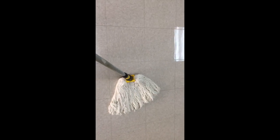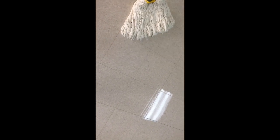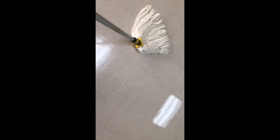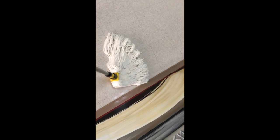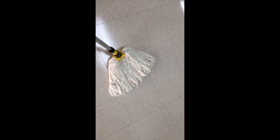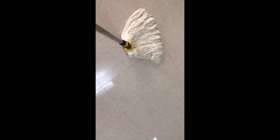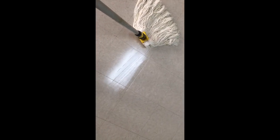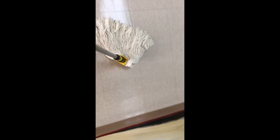Okay, I'm putting the last coat on. What I like to do, I'm doing this one-handed, but I'm going to kind of show you, is I really pay attention on this last coat, keeping that mop really flat and overlapping where I won't have any streaks. And I also did my edges again. You see those streaks right there? They're showing up. So I'm in some pretty good light.